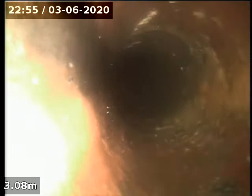So we'll just measure that out. We're in the trap. A metre out from the trap, a metre in. Metre in is earthenware, which is the old clay pipe, so it's only about there. It should have been renewed to the boundary line, but it looks like earthenware, pretty sure. It's orange. And it's relined here.